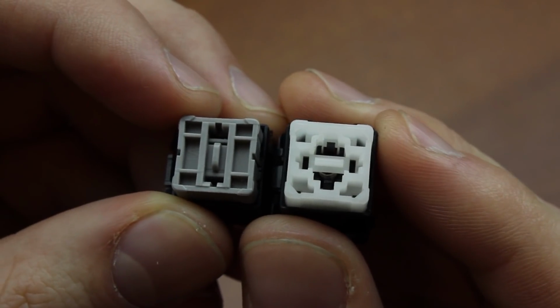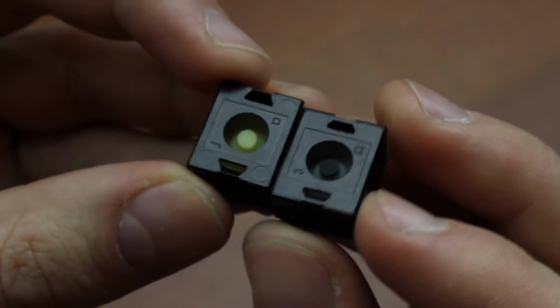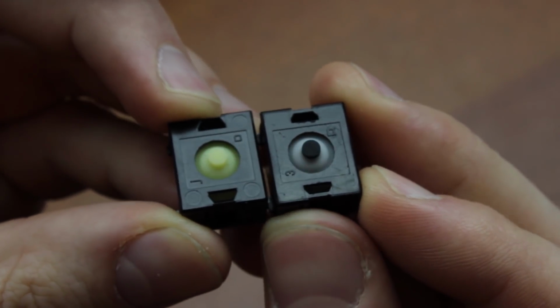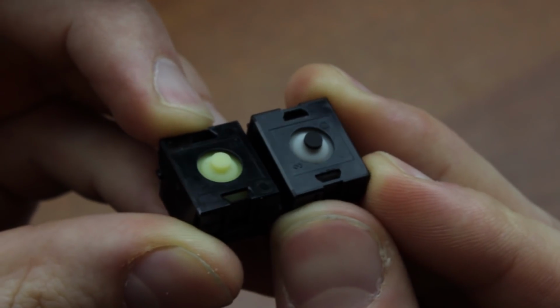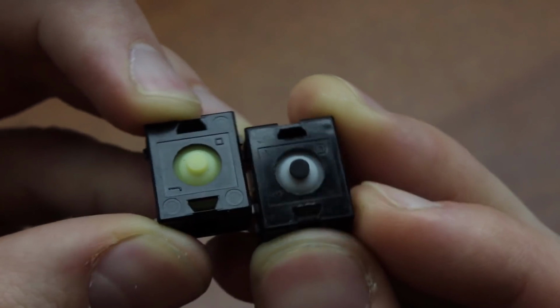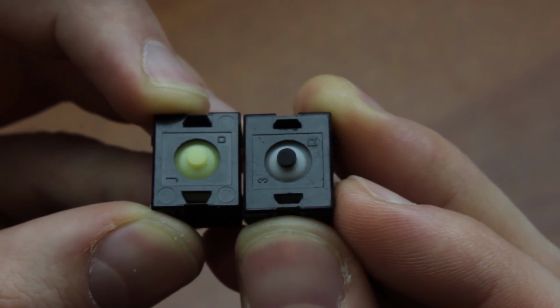See, if you open up the board and look at the switches, you'll find that first of all, the domes are yellow rather than light grey, and second, there is still some sort of pusher on the bottom of the domes, but it's not black and neither is it conductive. There is also no spring inside, making this a bit of a switch misnomer. Personally, I'd go for something like SMK integrated dome.